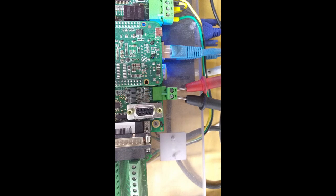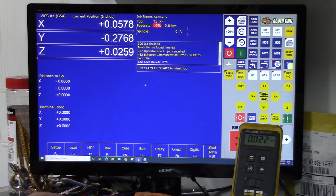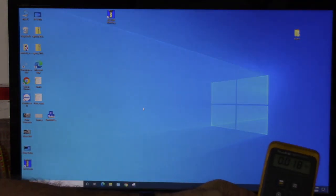The first thing you need to do is get a DC voltmeter, make sure it's set to DC, and connect it to the spindle analog output terminals on Acorn. Black to common, red to the output. My Acorn is set up from bench test mode with nothing connected — just the DC voltmeter connected to the spindle analog output terminals and an E-stop button. Make sure you're on DC; it's okay to see a little bit of residual voltage from the spindle analog output.